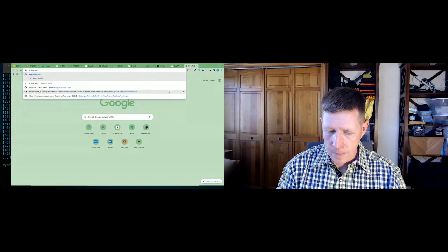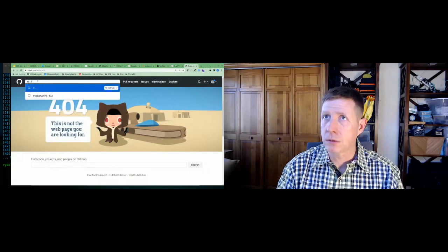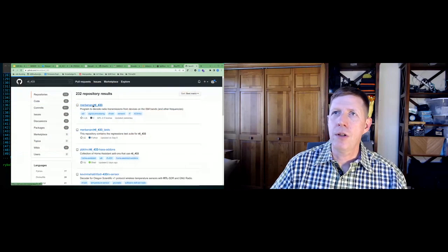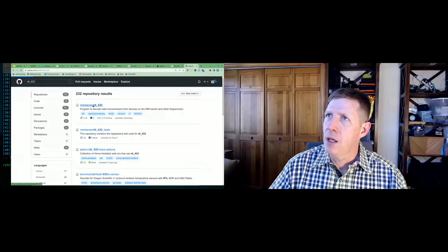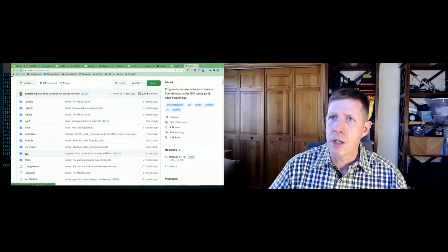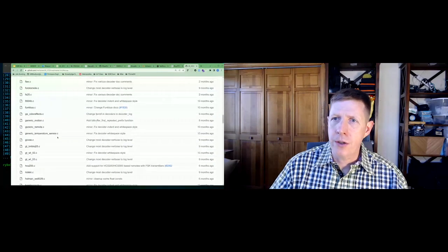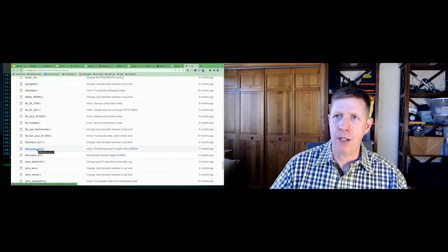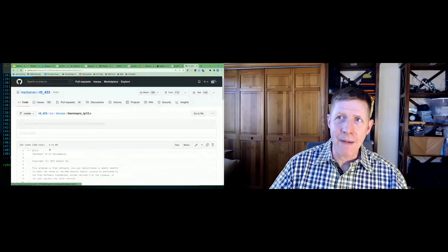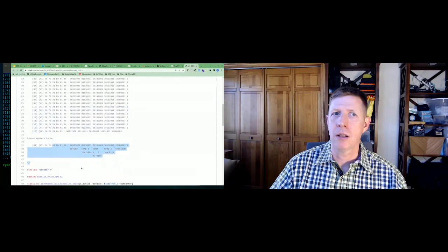Okay, come on now. There we go. If you look at this rtl_433, this is the source code repo for it. It has all the same things that are on the website. But if you look under, I believe, source devices, you'll have all of these different devices and you'll have C code. So if I go down to probably a T, it'll be ThermoPro TP12.c. This is actually what that particular sequence looks like, what the breakout is and all of that stuff, and then the actual C code that will grab it all.